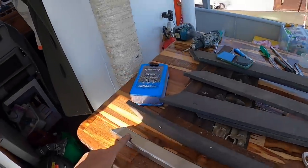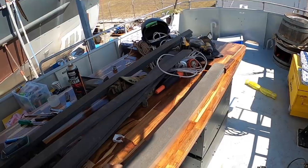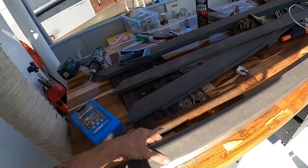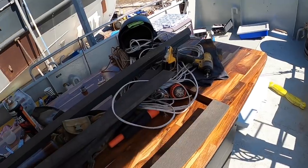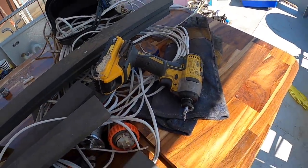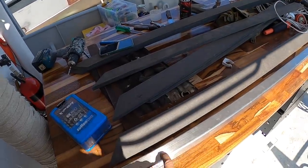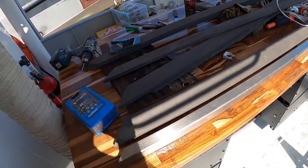This is the box stainless steel I'm going to be using at the bottom of the door, and this is the trimming made out of a sort of recycled polyboard that won't rot and doesn't need painting. I'm going to drill a pilot hole through the board into the steel so they're lined up perfectly, then use one of Damien's special little drill-tap combos. This is quite thick wall steel. Once we've got this drill tap done, I'm going to weld it on and then we can screw the outside trimming onto the steel.